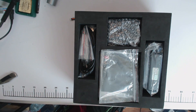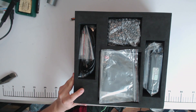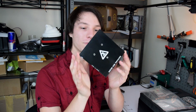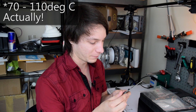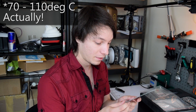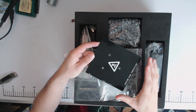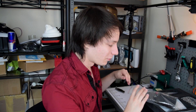The Trinus 3D printer in its box. First impressions — amazing packaging. This thing weighs heaps. We've got the heated bed. The Trinus uses a heated bed system that's completely self-contained, so you just apply power to it and it will warm up. There are two temperature settings, which I believe are something like 50 or 80 degrees. It looks very similar in design to the Up Mini bed, including the print volume size — it's only about 120mm, so not that huge. The bed volume is quite small, but I worked with the Up Mini for years with no real issues. That's the heated bed option. Don't forget this is an upgrade — the machine usually will not come with a heated bed unless you get that upgrade.